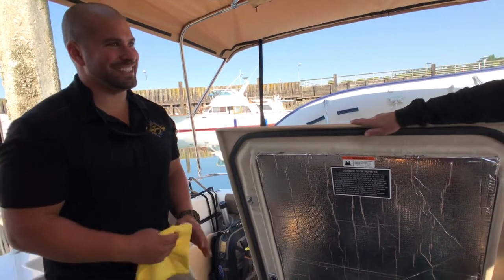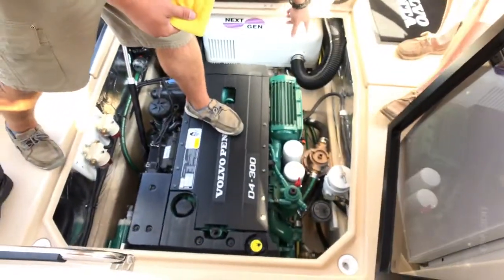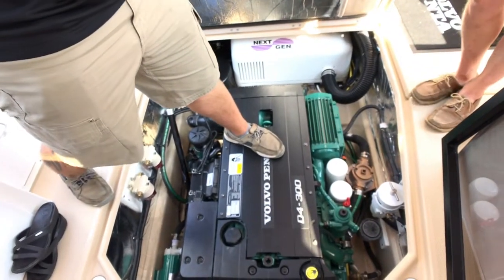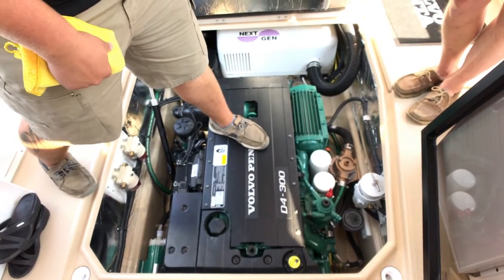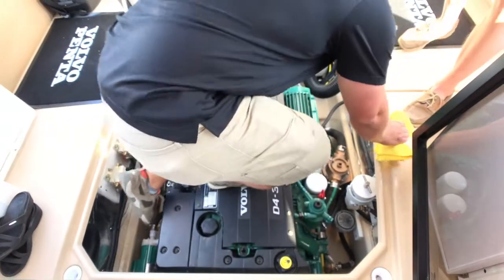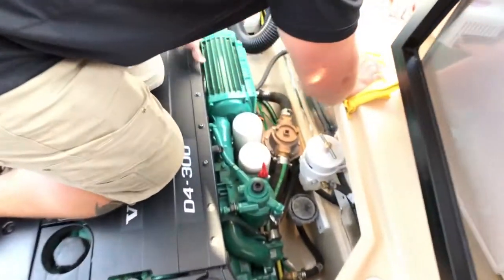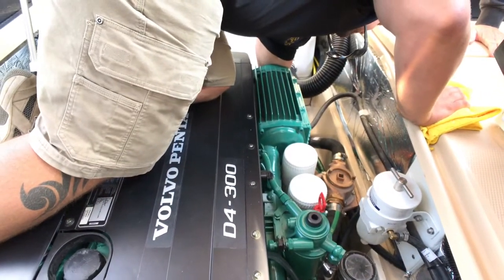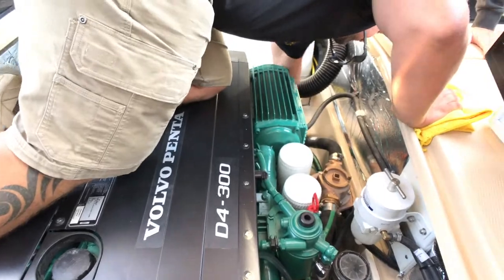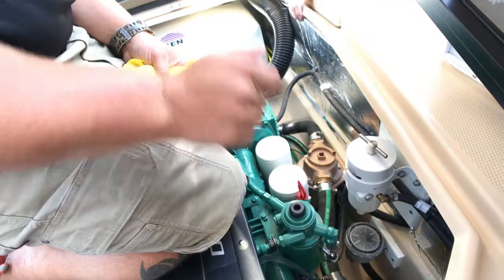If you're going to stay, you don't have to check all this. So the first and most important thing is to make sure your seacock is open. You have multiple through-hulls because you have the gen and air, but you have one solely for the engine. Your seacock right here is just for your raw water strainer for the engine. To shut it, you just flip that lever down — same as before, except it's a little bit bigger hose because you need more water for this engine.